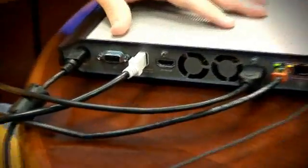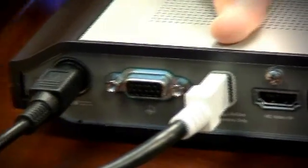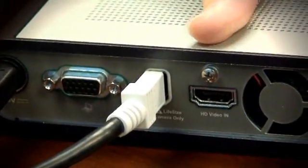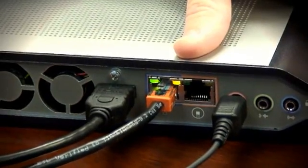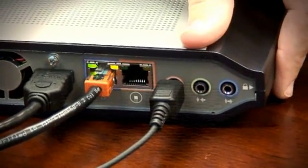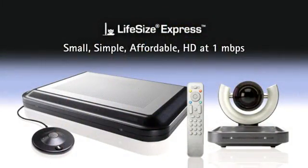So let's go back and go through these one more time. First, we have power. Second, we have VGA input so you can connect your PC up to it. We have dual stream, standard on Lifesize Express and all of our products. We have the camera, the same standard camera interface that we have on Lifesize Room and Team. Next, we have high definition digital video input, high definition video output. We also have the RJ45 connector for the network. Next to that, we have the same connection so we can connect our Lifesize phone. And the next three mini plugs are for audio. The first one is microphone input for our Lifesize Mic Pod. Next is line out for either headphones or external speakers. And last, we have line input.